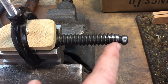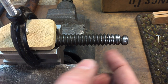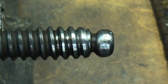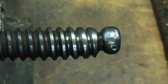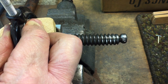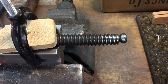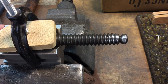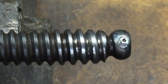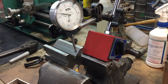We were able to get it out — it took quite a bit of force. Now look at the bend here: watch as I spin it and you can see it's a pretty nasty bend at the end. That's going to spin the swivel pad all over the place. We've got to straighten this out. It has to be held down while it gets pressed down, so I have to think about how we're going to straighten that piece out. That bend in there is quite extensive — we've got to straighten that tip out.